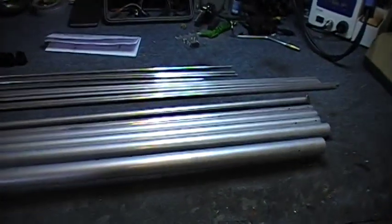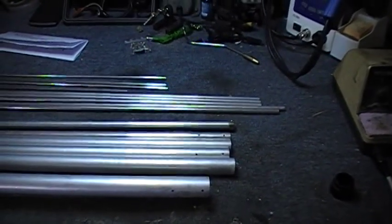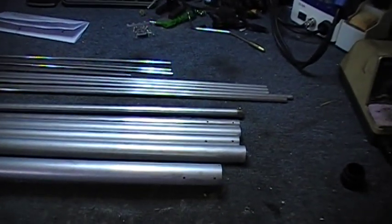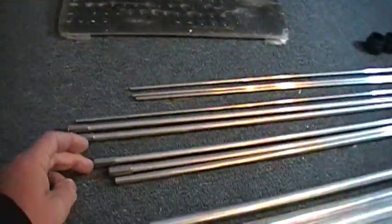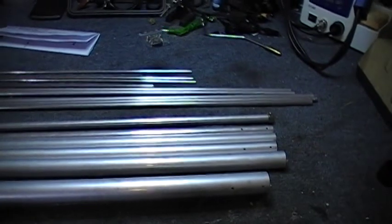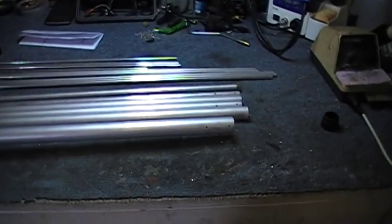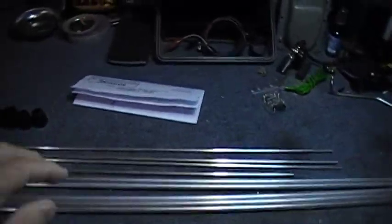Alrighty, now that we got this out of the way, we'll look at the antenna, and hopefully I'll be able to zoom in with the camera. You can see where I actually got in here and made the reinforcements on it. And then we're going to take a look at the sweep of the antenna. So what we're going to look at is probably a 1 megahertz bandwidth on the antenna, and we'll look at the standing wave across the 1 megahertz bandwidth, and we're going to compare that to their chart that's in this piece of paper here.